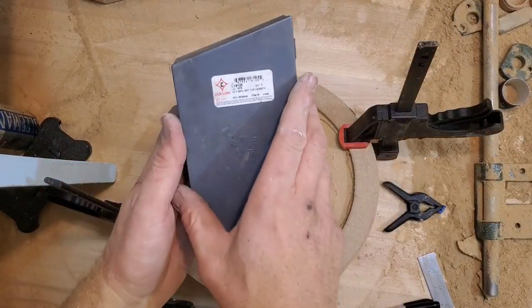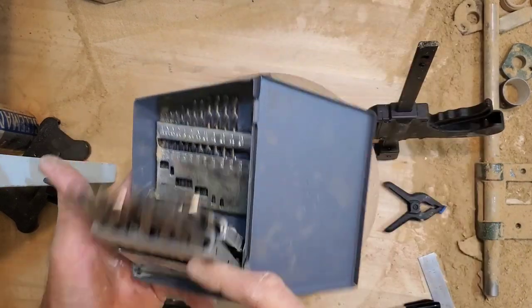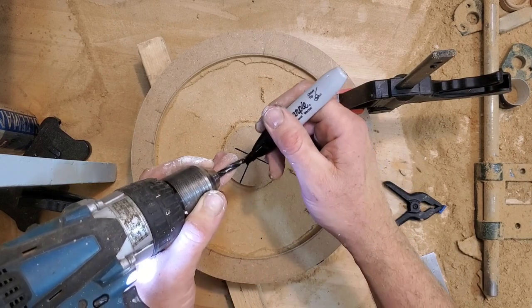At this point now, you're going to want to clamp the two together. We're going to have to put dowel pins in. I had a couple of little metal plugs that were conveniently laying around the shop, and I'm going to drill in three places to a depth not to poke through on the other side.